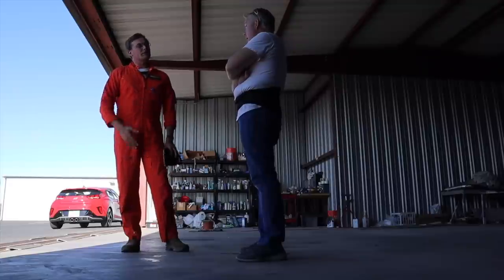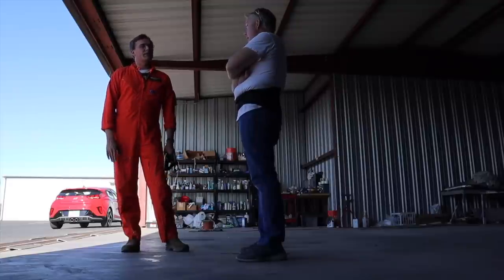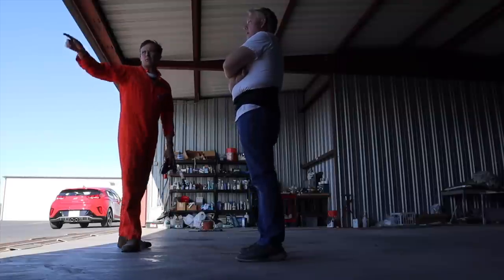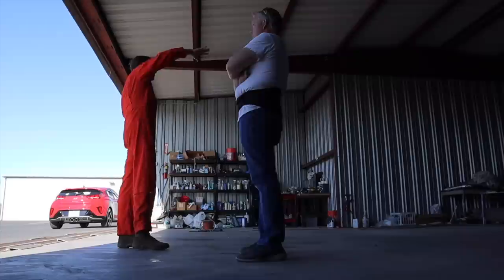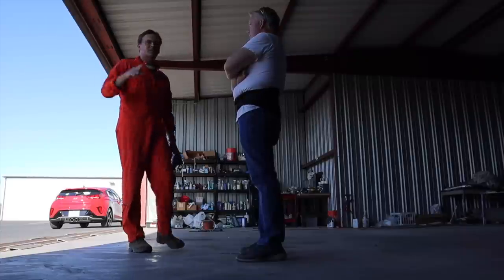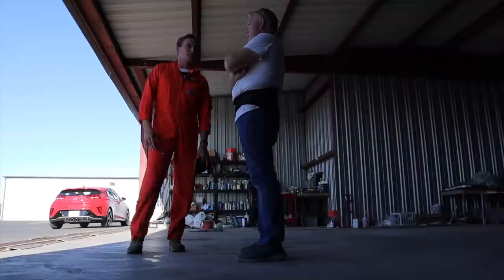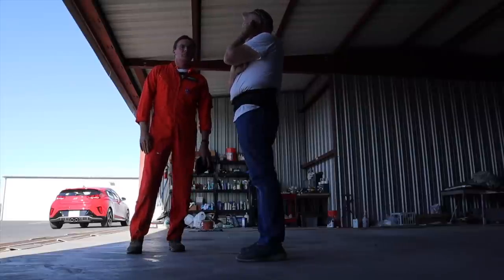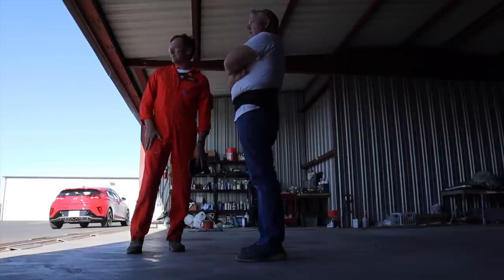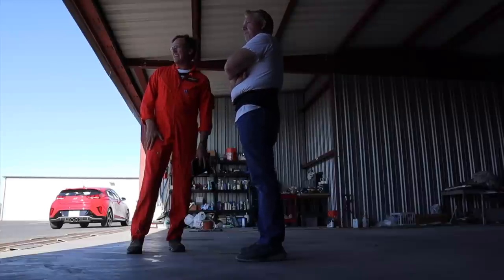And there was roughness that was kind of coming and going. Once I got above the glide cone, it was fine, but there was one moment, waiting on the runway, just barely on the edge of the glide cone, I'm like, man, does this suck? I don't know. But once I got a little higher, I wasn't concerned about it. And of course, as soon as you're not concerned, you don't notice it. There may be a little roughness, and I would say it's cylinder number one. Let's do it with a new plug.